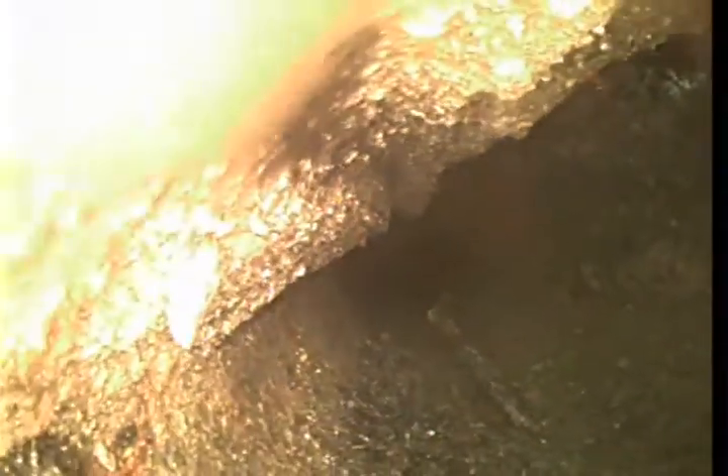Really rough and rusty on the bottom of the pipe. Looks like we're going around another couple of turns, and then we've got what looks like more rust debris or gravel — I'm leaning towards rust debris personally. The whole pipe is caked in this section — you can see it even forming around the camera. There's actually a little bit of standing water right here, maybe about half an inch. I don't think this is back-pitched — I think it's just the fact that the line is totally filled with debris in this section and it's not letting anything flow by.